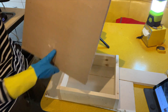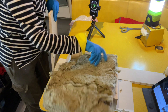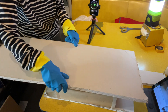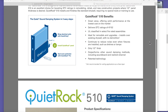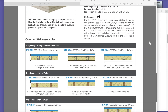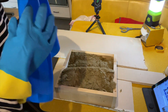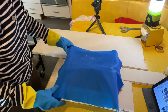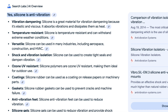First, we'll measure a hollow wall covered with a standard piece of 5/8 inch drywall. Then we'll test it again with rock wool insulation inside the cavity. We'll also test it with a half inch piece of quiet rock drywall instead of the regular drywall — of course this quiet rock is 1/8 inch thinner than the standard drywall; you can buy 5/8 inch quiet rock but I didn't have any. After that, we'll test the noise again by putting a sheet of silicone between the wood and the drywall. This might not be enough to dampen the connection, but we'll see — I don't have any scraps of mass loaded vinyl on hand, so I thought silicone might be interesting because it does have anti-vibration properties.